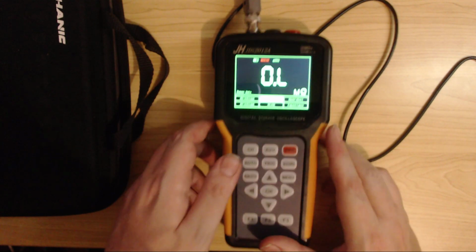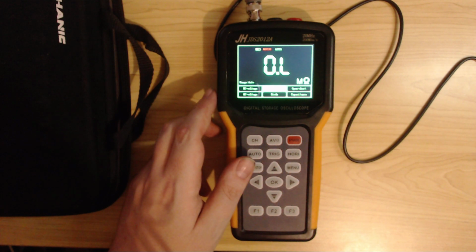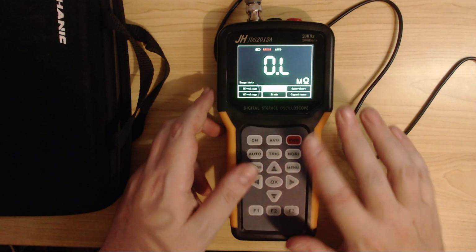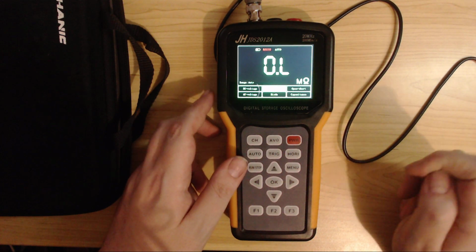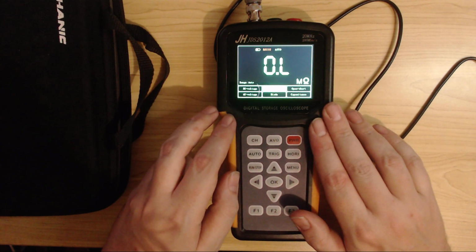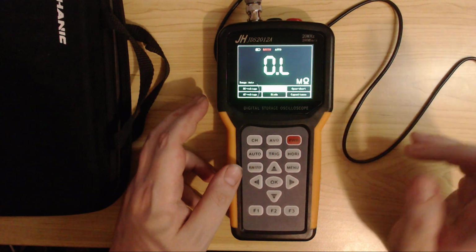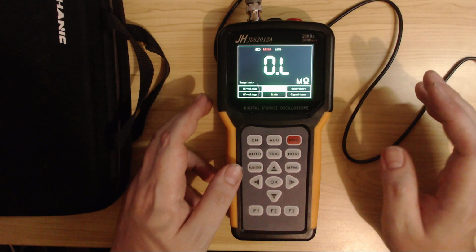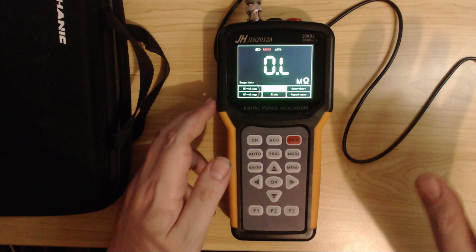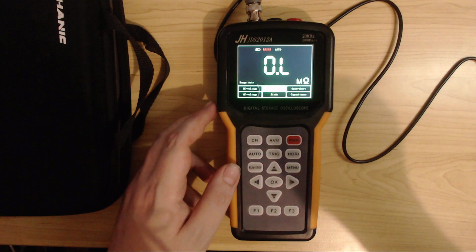We were talking a little bit in the electronics channel the other day about multimeters overshooting the original signal as you apply the connection. Now, personally, I don't think this is a big issue at all. I've tested a really old meter that I have, and it didn't overshoot at all. If I applied it to a 12 volt source, it counted up. First reading was about 8 volts, then 11 volts, then it stabilized at 12.7 or whatever.